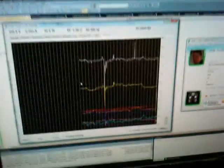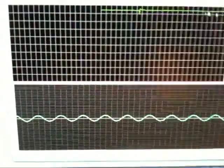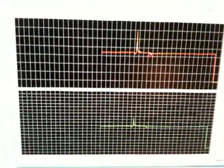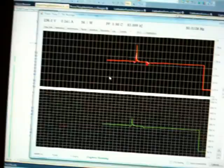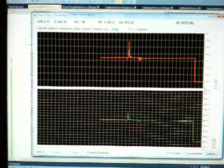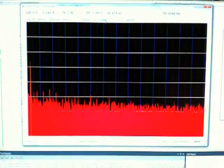Let's unplug it and take another look at the current. We've now just got a single 60-watt bulb plugged in — a little bit dim. You can see immediately that the harmonic distortion has dropped right off, current has dropped off and there's a nice sine wave. Power factor's jumped up to 0.98, reading currently about 56 watts. This is calibrated purely on the basis that that's a 60-watt bulb — I've got no idea if it's accurate or not. That's the voltage spectrum there, though actually it looks awfully like the current spectrum — I think there's probably a bug in the program.